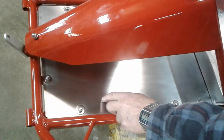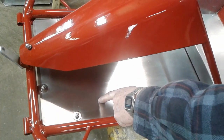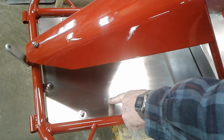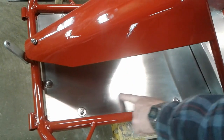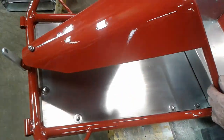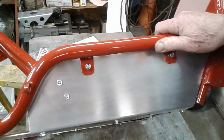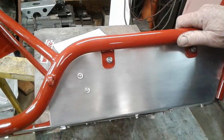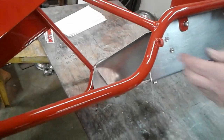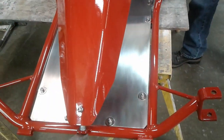This is what I was talking about with the Rathman guys. If you don't want to polish your Rathman and you took the anodizing off and it's kind of beat up, sand out your worst areas, and this is actually finished with triple-aught steel wool and WD-40, and it ends up with that brushed look. It's not polished, it's not shiny, but it hides so much. Did the same thing here on the sides. Normally on our alley cats we polish all of that, but this is that brushed aluminum look.